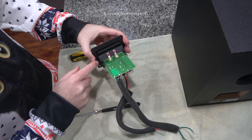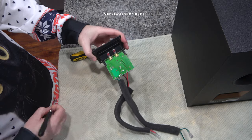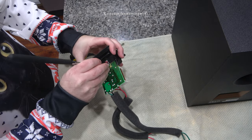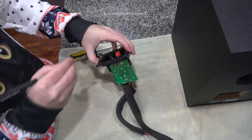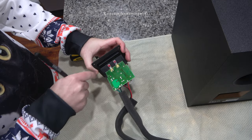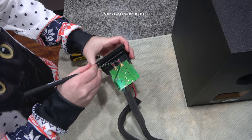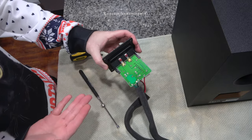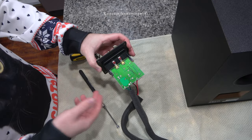And then we have these little tabs that go from the binding post and they lead into the crossover here. And I don't believe those are made out of steel either. They're not magnetic. But the nuts that fasten the binding post to the terminal cup, the ones that are colored in red, are made out of steel. And these could be replaced very easily with ones made out of brass. And I'll leave a link in the description to some brass nuts if you'd like to replace them.